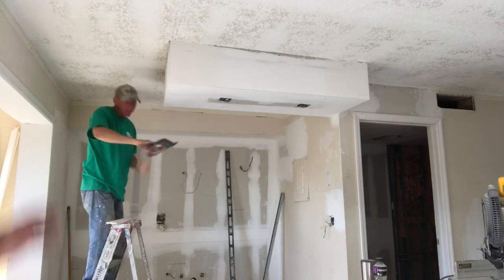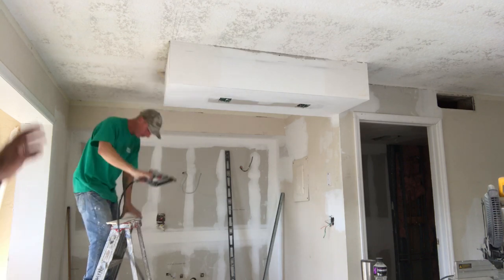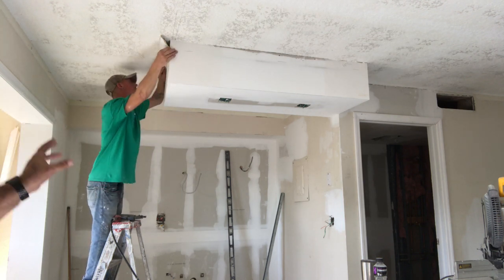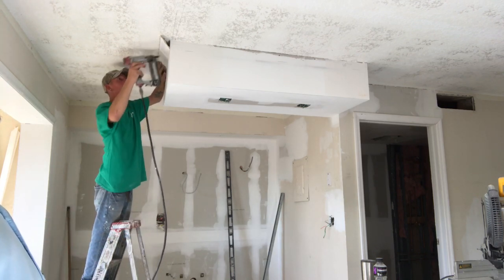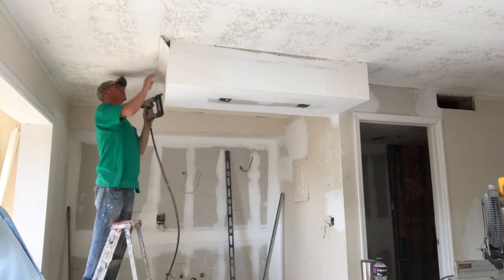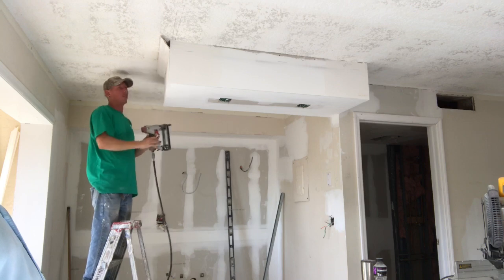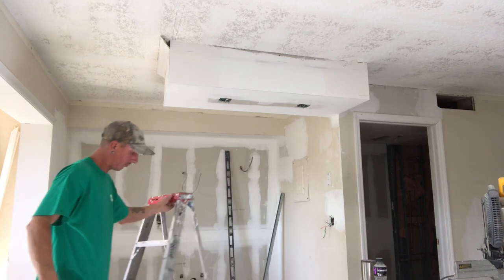And Kevin had already cut the back side, put that up. He tacked it. Now he cut the front side. He's 45 both. Remember, I told you what is the bottom of a crown and what is the top. I showed you that in my balance video. And then we're just tacking it right now, working our way around the soffit.